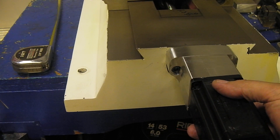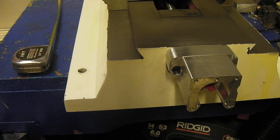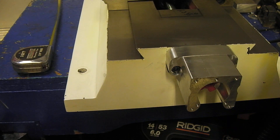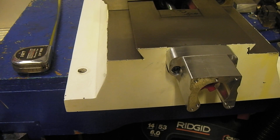Your NEMA 23 mounts will fit like this, and a lot of people want to run NEMA 34, which also includes — DMM has an 86N. Not the M — M is metric. The N version stands for NEMA, and has a NEMA 34 mount.